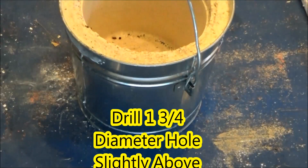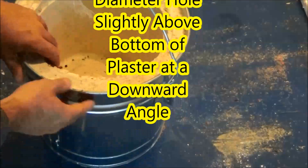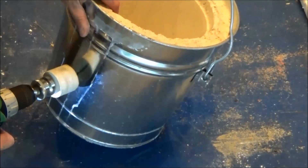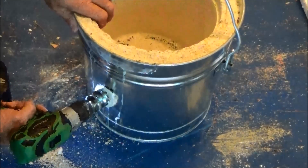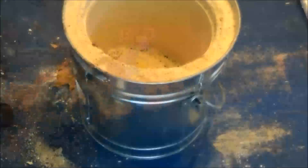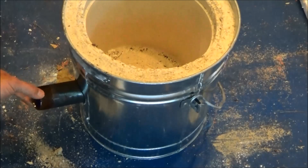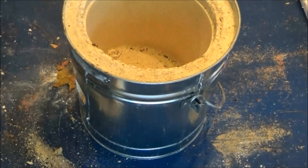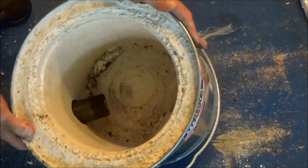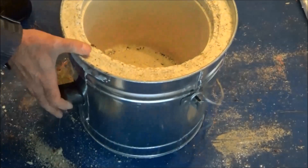Remember at this point the plaster is still kind of soft. After letting the foundry dry for a couple days, I took my inch and three quarter hole saw and drilled a hole about an inch up from the bottom at an angle, angling towards the bottom of the foundry. This will make sure that if, for some reason, your crucible leaks out aluminum, it doesn't run out of the tube. Here you can see that the inch and a half steel pipe fits in nicely. It's a little loose, but that's okay — we want it to be a little bit loose so it doesn't crack the foundry if something moves. Here's a view of the angled hole pointing down.